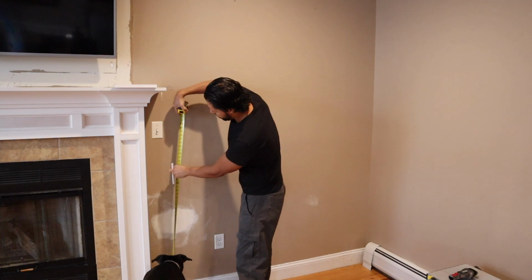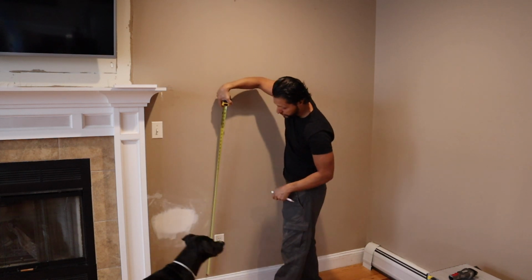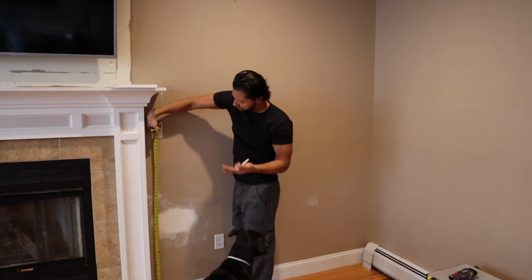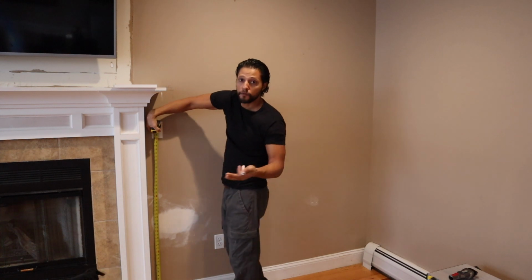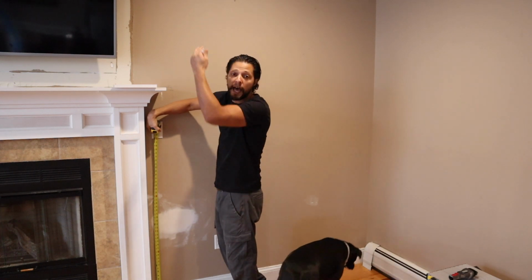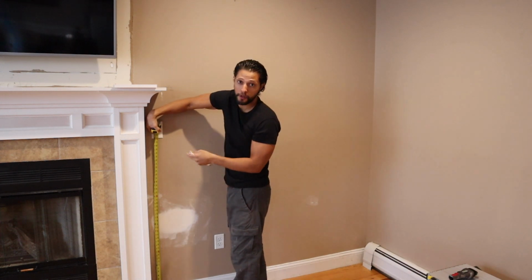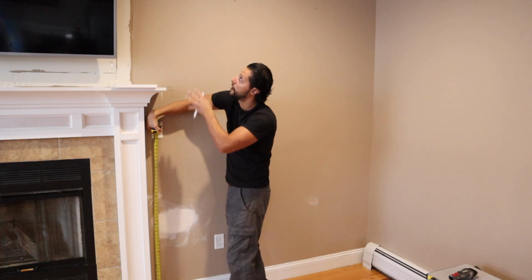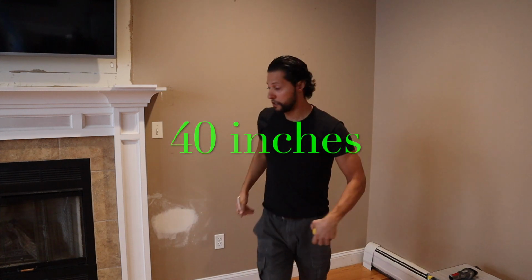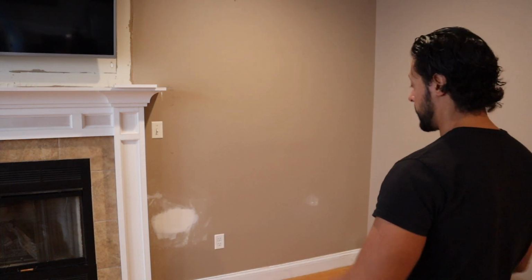and I'm pretty lucky because I'm not going to have to move any of the light switches or the outlets, because they fall within plenty of room for the tolerances of where I need to be. Now, normally chair rail, you can go anywhere from 32 inches, 34 inches, all the way up to 50 inches. It all depends on the height of the floor to the ceiling. You don't want to split the wall in half. It just doesn't look right. You want to have that proportion of the bottom being a low chair rail and a higher upper part of the wall for the separation. All right, so that's going to be for the top of the chair rail. So I'll set up a laser level so that I can get that line and really see how that looks.